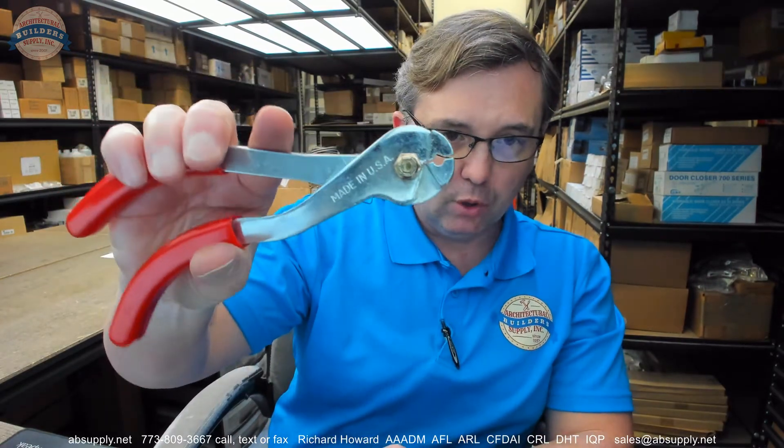The cable is used to go from the pull station through your steel tubes, through your corner pulleys to your actuating station — sixteenth of an inch cable. You need the crimp sleeves as well, and the crimping tool is awfully handy to have. Even though it's not necessarily an inexpensive tool, it is the quickest tool to use and the one that is going to be properly crimping that material.